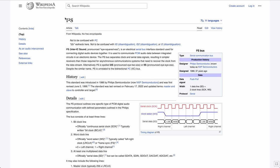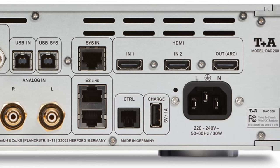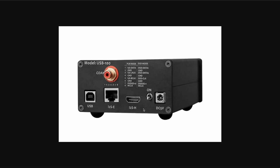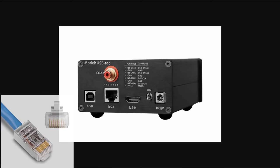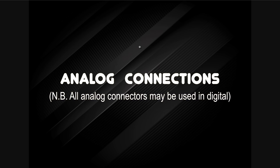Because of I2S compatibility issues, many people are moving back to a simple HDMI-type connection. HDMI can carry LPCM up to 24-bit/192kHz or DSD64, while I2S can deliver much more — practically unlimited — up to 768kHz at 32 bits and even DSD1024. I2S can use not only HDMI but also RJ45 or practically any connector type.